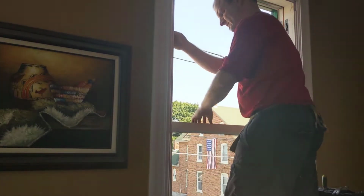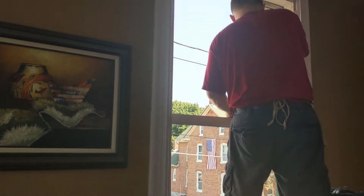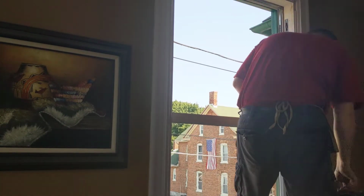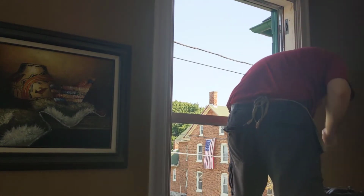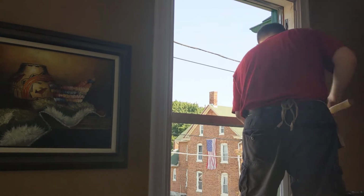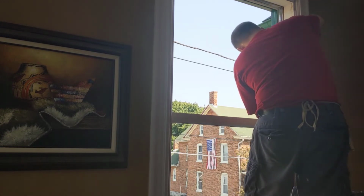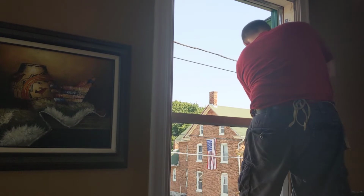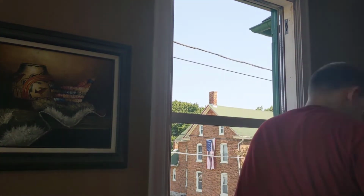And basically, you're not able to see it too easily, but I'm pulling the pins out of the chain, so now the window sash is suspended under weight, and you can see that I have the weather strip in place on the right side, and I'm tacking it in place. Unfortunately, you couldn't see how I slipped it into place with the sash there. I'm just putting a couple nails in. I'll end up testing the sash going up and down, and then I'll finish putting the rest of the nails in.